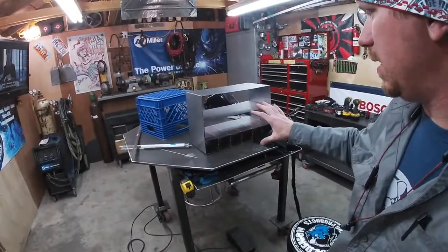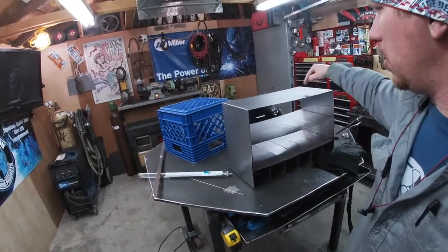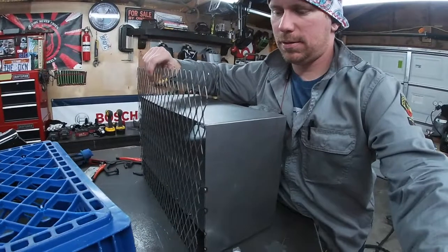Let's be honest, dudes — it wasn't me that burned them up, it was the dude I was teaching. I got lucky just barely, but I'm one of the luckiest, and that's just a fact. I've got the whole shelf tacked up, but I have this wild hair: because these shelves are a little flimsy, I should have broke a cross into them like I did with the generator lid — you always break a cross for rigidity. Since I didn't, and I need to mount this anyway, I'm going to use the old expanded metal on the back like this. I'll tack the shelves off that — it'll give them all the strength they need. I'm going to mark it up, use an angle grinder to cut the metal, then tack the back on and space each shelf so everything is nice, square, and trued up.